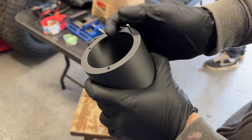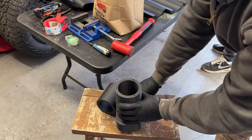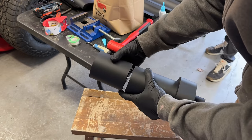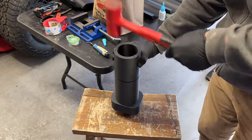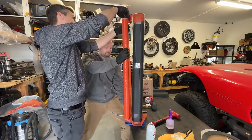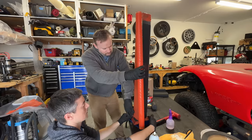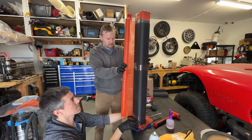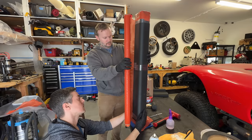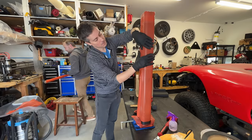With the parts all printed, it was time to make some carbon fiber — right after sticking dowel pins in all those plastic parts and gluing them together. I made the holes slightly too small, so it deformed the plastic just enough that they wouldn't go together flush. It doesn't actually matter — very little of this part matters dimensionally, which makes it a great project to get back into composites. The way around getting parts stuck in molds is to use lots of mold release and carefully prep your mold by sanding, adding a thin candy shell of epoxy, sanding that a lot, and adding wax and mold release. Or you just wrap it in release film — not actually saran wrap, but expensive composite saran wrap. The problem is it always folds over and leaves wrinkles in your part, but I do not care what the inside of these tubes look like. So we got some spray adhesive and stuck it on.